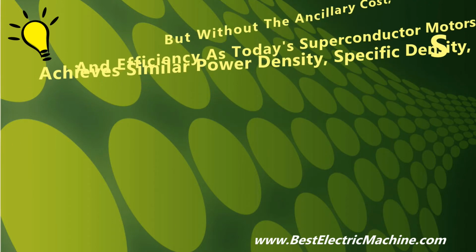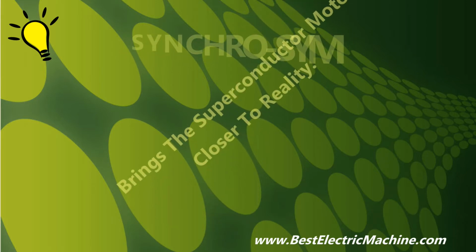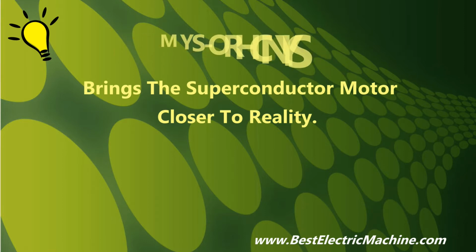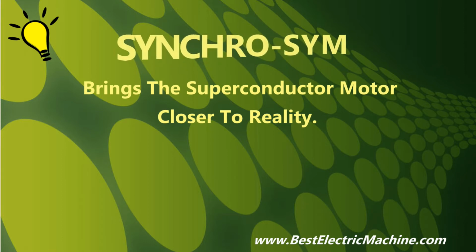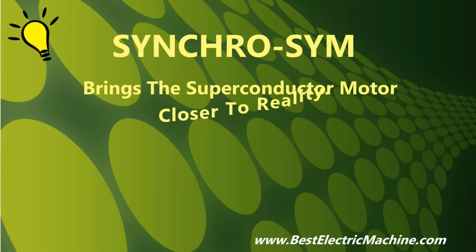Ironically, SYNCHRO-SYM's brushless real-time emulation controller, or BRTEC, can bring the traditional superconductor electric motor system closer to reality by at least conveniently relocating the superconductor DC field winding to the stator for simpler cryogenic support, for brushlessly relocating the active multiphase winding set to the rotor, for eliminating the slipring assembly, and for reducing costly harmonic heating as only provided by BRTEC with inherently pure multiphase sinusoidal drive waveforms for variable speed control.